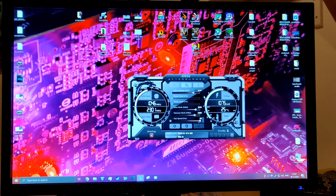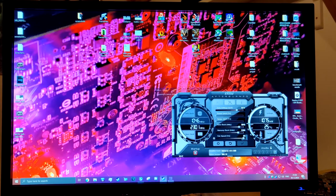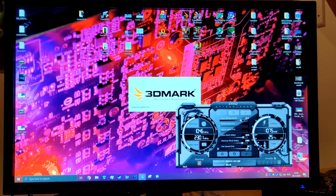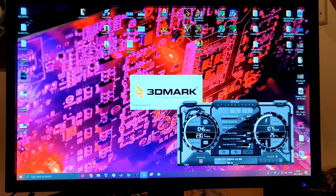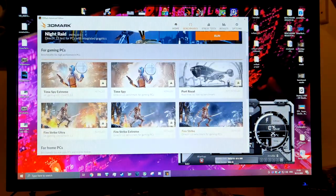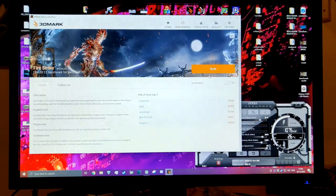I'm putting the usual 1.25 volts at the VRM on this one because, well, it is a reference card. And the VRM might blow up if I give it more. I've run it on 1100 on this, which is close to 1.3 volts-ish. You put in 50 millivolts more here, you don't actually get 50 millivolts more, you get something like 65 to 70 millivolts more, actually. Which is probably just the volt mod interfering with however this voltage setting works. Yeah, but I'm not gonna waste any time...